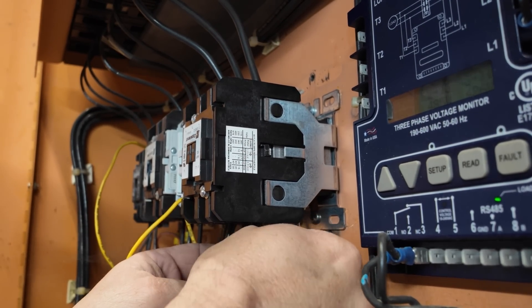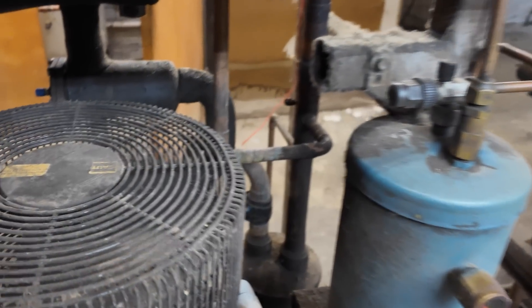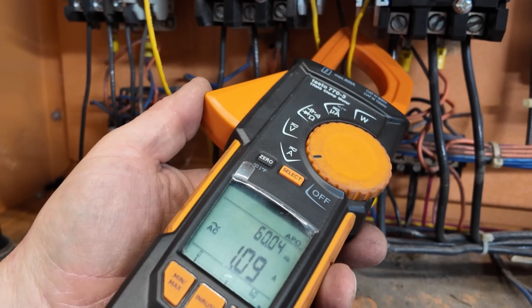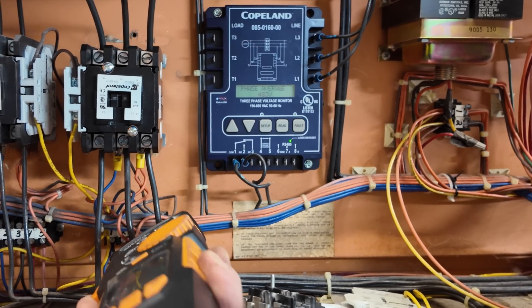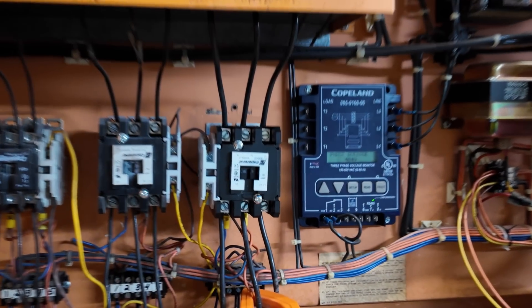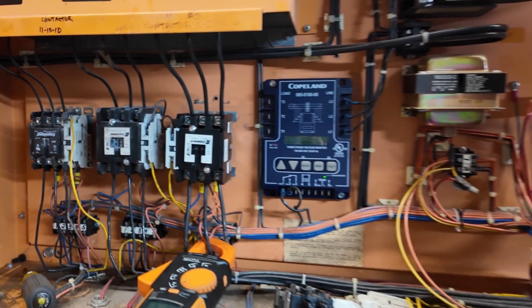We're getting into the thread — so we got that. Look at this fan — look at that! Imagine that, right? It's actually working. Check the amp draw on it: 1.09 amps, so that seems about right. Still got the main power off. Let's go ahead and check this one more time — go ahead and kick that on. Turn away: 137 amps. Still looking pretty normal. At this point we're going to let it run for a little bit and see what happens.